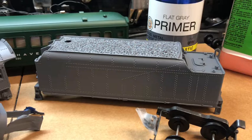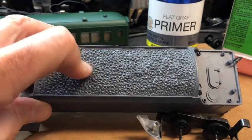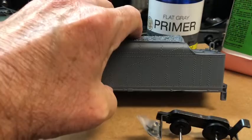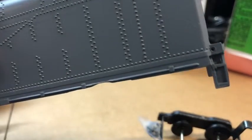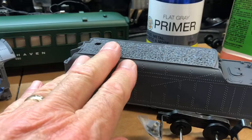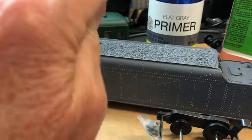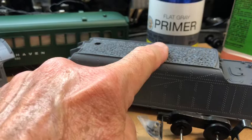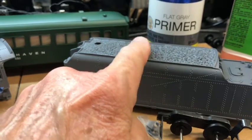Use the same tools and methodology and Simple Green on the tender. It always does a very good job of getting things like the coal bed extremely clean, separating paint all on the sides and down the cracks and crevices and the relief of the piece — all the rivets, all the fine work on the front and rear, even the interior of the steps. Same process on the tender, and I've always been real pleased by getting the nylon brushes and going over the coal bed. I soaked this one about 48 hours because coal beds are always difficult to get paint flakes and pigment out of, but I could get probably 98 to 99% of it out.